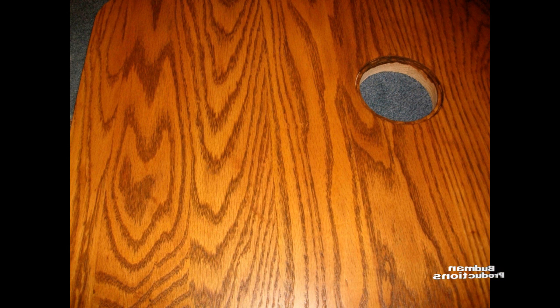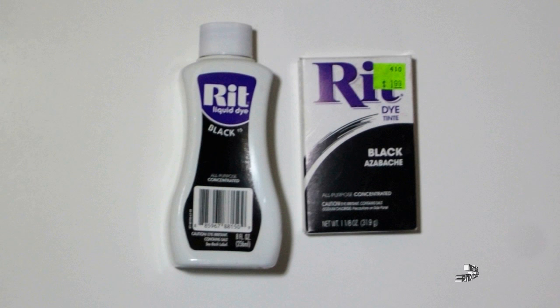This dye mixture not only enhanced the grain, but it also seemed to emulate the color of the original oak on my desk. I know I would get a lot of pushback from traditional woodworkers on the use of RIT dye, but that's exactly what I did with this project. If you take RIT dye and mix it in very hot water in a bottle and shake it until it's thoroughly dissolved, I see no reason why you can't use it. A bottle of dye from a woodworking store is going to cost you about $10 to $15. As you can see from this package, powdered RIT dye costs about $2. So that's what I used and I see no problem with it.